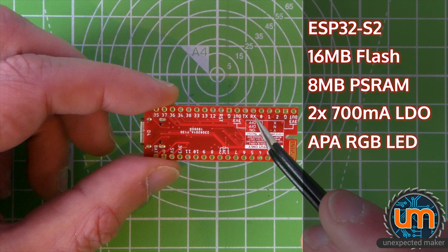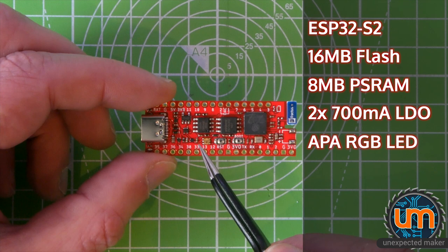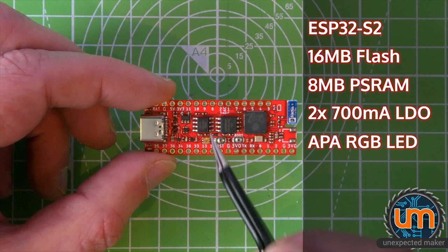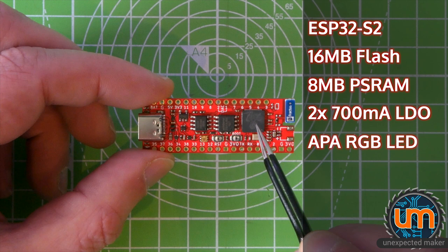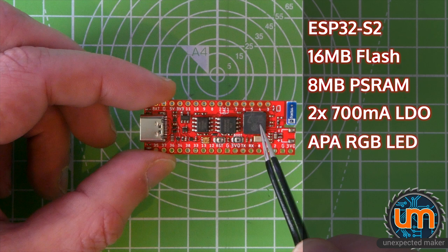So that way you're not pinching needed current capabilities from the onboard LDO that drives the ESP32 or the other peripherals. And it also means that you can control the power on and off state via that LDO with the enable pin via both GPIO21 and the deep sleep state of the ESP32-S2. So if the ESP32-S2 goes to sleep, it'll automatically shut down power to that second LDO. So anything connected to it will power down automatically. But if the ESP32-S2 is awake, then you can control whether the power is turned on or off by GPIO21.